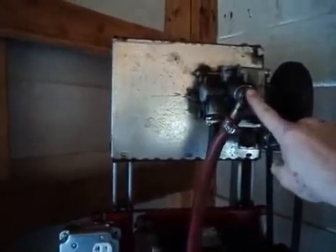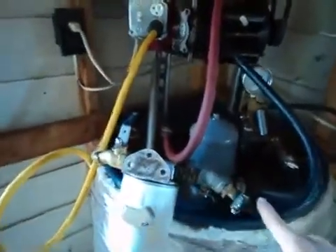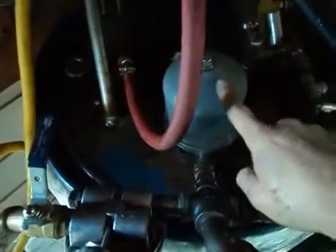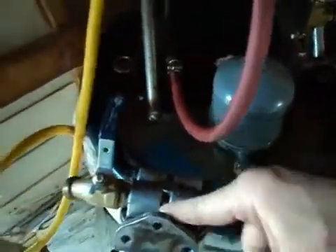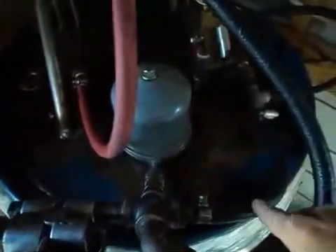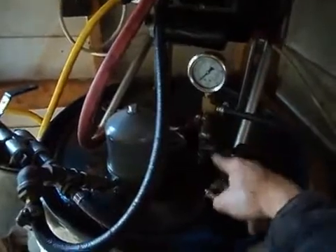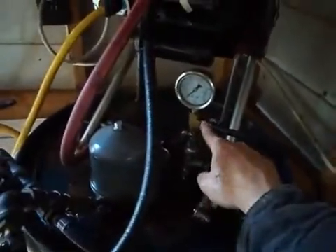Let's start from the top. I've got a pipe that goes all the way to the bottom of the tank, comes around, and goes into my power steering pump which came off a BMW. It'll pump up to about 150 PSI. It comes out at around 140–150 PSI through this high-pressure line into this 90-degree fitting. From that 90, it's got a 4-way. This 4-way goes down to the centrifuge, out to this filter with the spigot, and also out to a bypass valve rated at 100 PSI. From the bypass valve, it goes to a T that drops into the tank, and also tees off and loops around to this T and this valve.